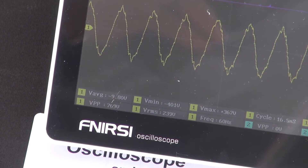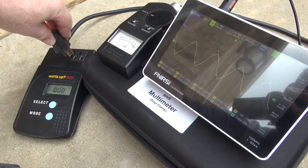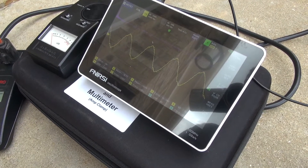So here's the waveform. It's definitely got the frequency right in the range of 60Hz, but look at the lines. This is what people mean when they say dirty power. Now let's add a load to it. We see the power frequency directly influenced by the strain of the engine needing to catch up to the added resistance.